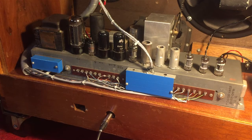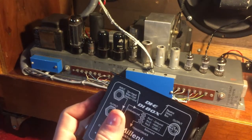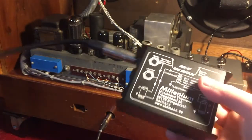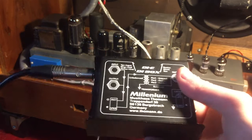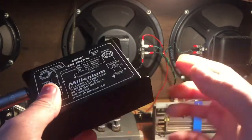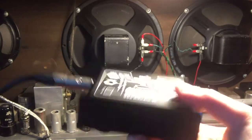In my case I just use what is called a DI box. A DI box has a very high impedance input — it has a transformer inside. So when you connect to the input, you're connecting the transformer to a very high impedance, which won't really affect the impedance you've matched with your speakers or resistor load. So the transformer will be happy, and you get a balanced output. That's very good, because you can have a very long wire directly attached to the Hammond organ — for example at a concert — and record without noise problems.